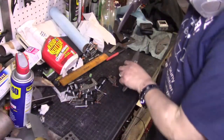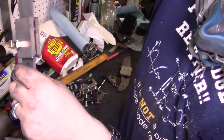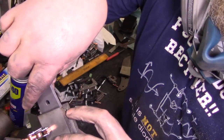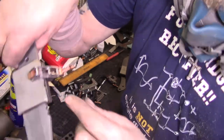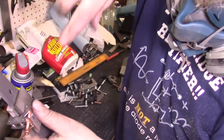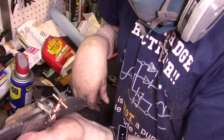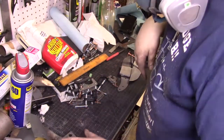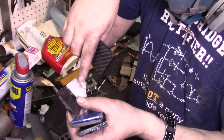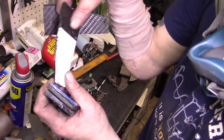Here's a little thing to show you what they're going to look like — we'll line them up here and here. The rest being uneven doesn't matter right now. The only thing that matters is this lines up, these two edges line up, and these two edges line up. Then we'll clamp one down, make our mark, drill a hole from the outside into there — flip it and do the same thing. That way we take a little pin and connect them together, make sure they line up, and then shape them out. In the next video we'll get the bolsters all drilled and maybe start shaping them.